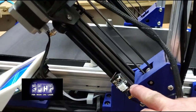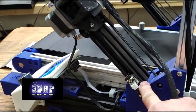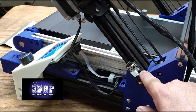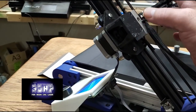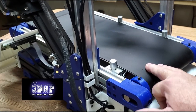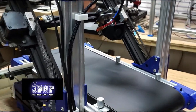I've got an end stop mount here on the side. My friend Liam, ASCRO printer, sent me a couple little mounts. I didn't really care for the way those were set up, so I have some different ones here. There's an end stop here on the X-axis, and I got this one here for the Y. Infinite Z for the belt — so when you go to home, it uses home X and Y, not home Z.